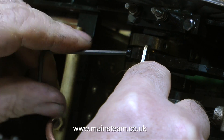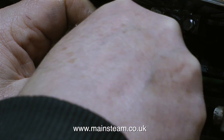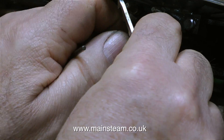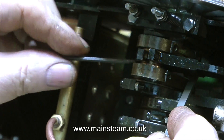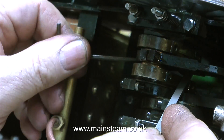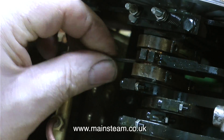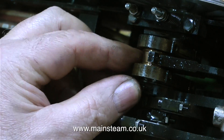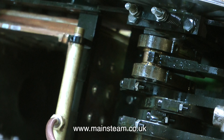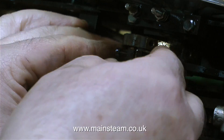I had a cursory glance at the big end bearings and for a moment hoped they were split bearings, because I've seen things from China where the phosphor bronze bearing is just a tube threaded onto the crank pin before assembly. Although this crankshaft was probably originally assembled with grub screws and found inadequate — it's now also welded together. I spent most of the morning thinking about how to remove non-split bearings, but thankfully they are split. That was a relief — it's a phosphor bronze bush, and split is a good thing, so I put the bolts back in and tightened everything up.